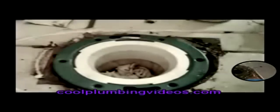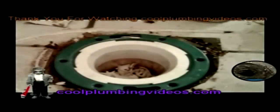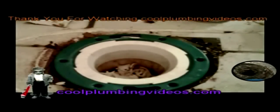In most cases, when you do a flange like this and you glue it down like we're doing here, you might want to let it cure for about 2 or 3 hours before you actually set the toilet in place. As you can see, this flange fit nicely.